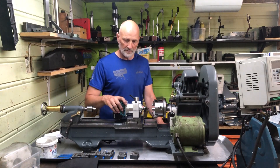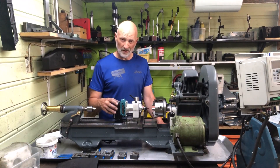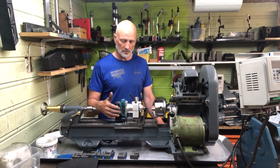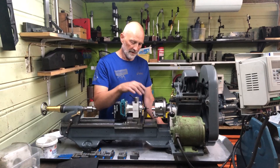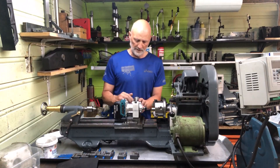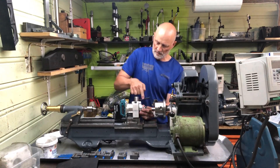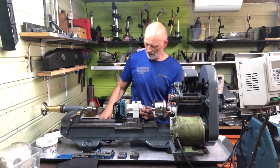As may be evident here, I mounted a tool post — not a grinder, I would say — but this is a wood router, a Makita type. I am using it for milling and for drilling. I mounted it in a holder in the top slide, and that is a very easily made adapter also.